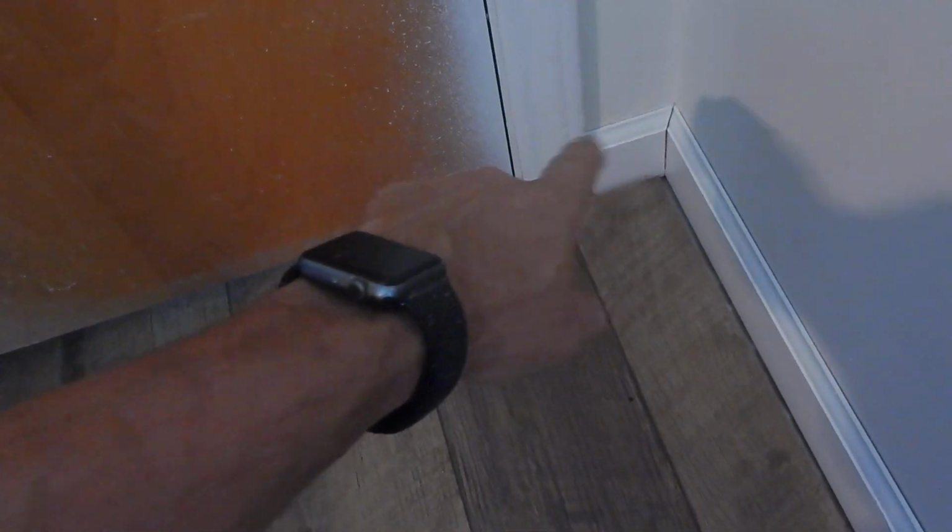Well, what we're doing here is we have a floor that is installed, and the baseboard was already in, and what we're going to do is put some shoe molding in to cover the gap that we have here between the flooring and the baseboard. You can see we also have some gaps here between where the baseboard was installed. So we're going to install this long run here and then this run over here. Now let me show you